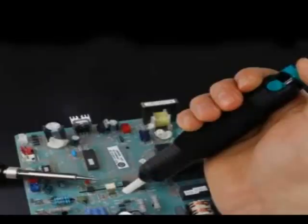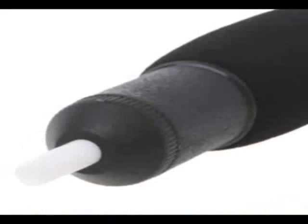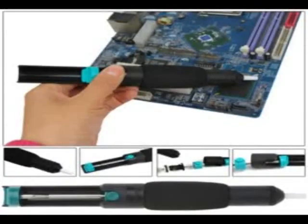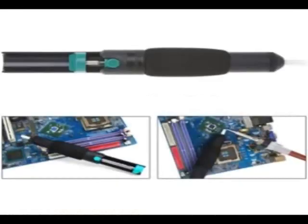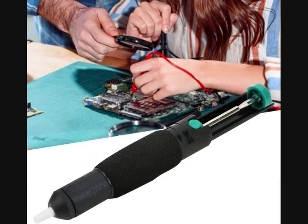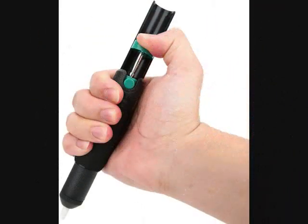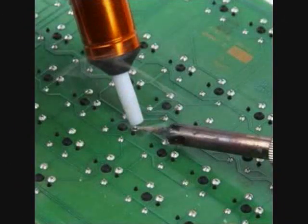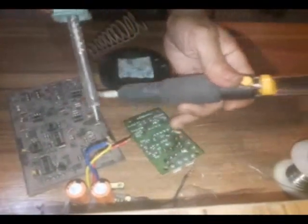Step 5. Clear the table. Because brown resin can melt when heated, you may find it sticking around the solder pad. You can remove it using a professional resin cleaner or by carefully scraping it away with a tiny flathead screwdriver or steel wool. Finish by washing the area with an isopropyl alcohol dampened toothbrush. The pressure from the iron or pump may cause the solder pad to slip somewhat. As long as the traces connecting the pad to the other components are still intact, it should still operate. If the traces are damaged, you must solder new ones on. If there are still remnants of solder on the pad, a desoldering braid, as detailed below, can easily take them up.